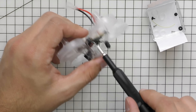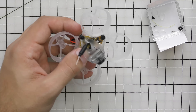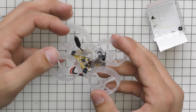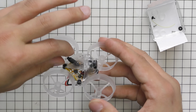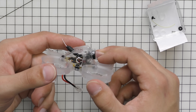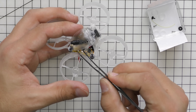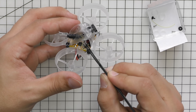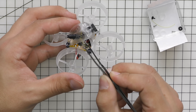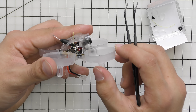Now install the screw on the front of the flight controller board where the camera is going to go, because as you can see on the canopy there is no screw hole there — it only screws in by the two sides in the back. Grab your tiny Phillips screwdriver; I highly suggest a magnetic one as it makes this really easy. Line the screw up in the hole and screw it in gently until it's sitting snug on the grommet — you don't want to cinch it all the way down, otherwise it'll squeeze it and push the other side up.